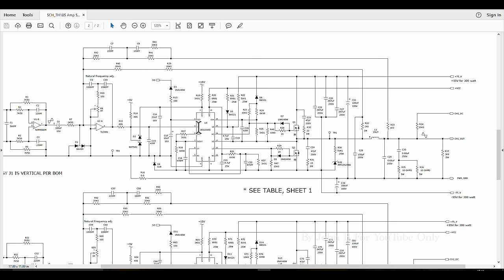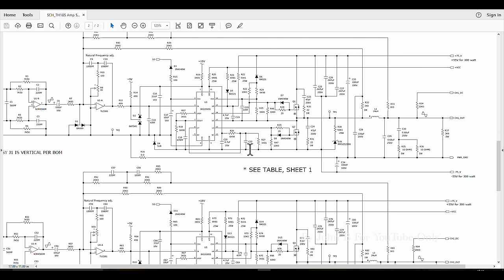And with the function of this chip and that, it oscillates at 400 kilohertz. You get a square wave coming out of the output. This choke takes out the 400 kilohertz, plus there's additional filtering on the extra board on this sub. But essentially, you've got two drivers. There's a high side driver and a low side driver. There's a low side FET, a high side FET.